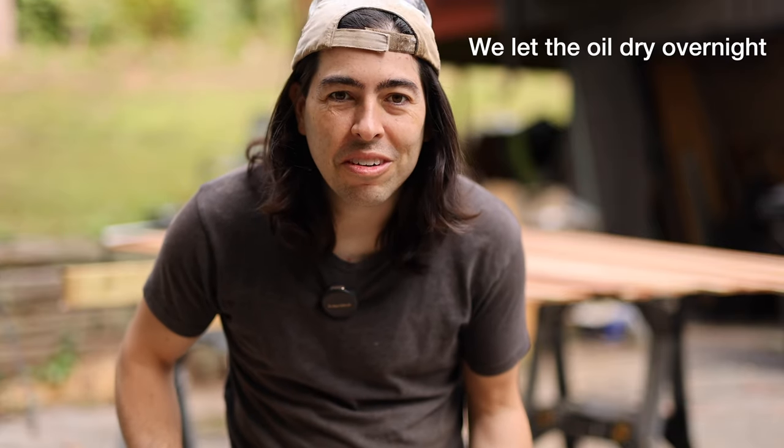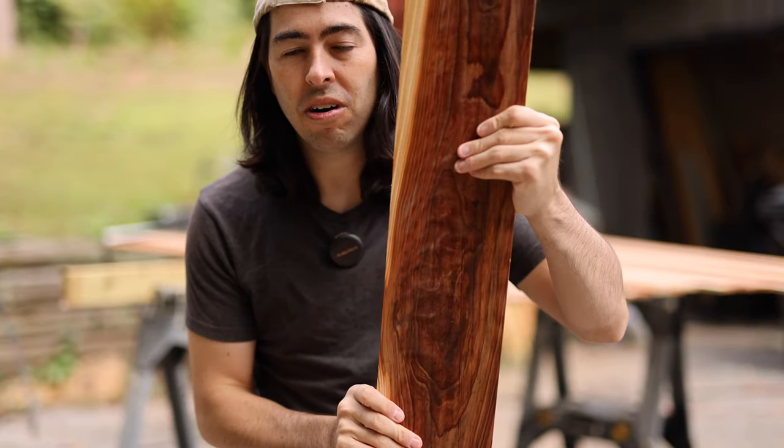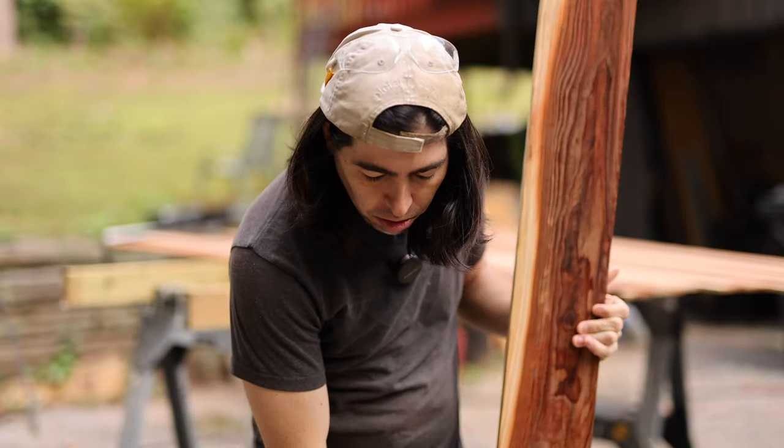Good morning. It's a great day to finish off some doors. So today we're finishing off. We've got to install the cedar. This is one of the pieces that we'll be doing vertically. It has a lot of character to it, so this is going to be our centerpiece. I'll be cutting down a whole bunch though. Some will be horizontal and some will be vertical. So the next thing I need to do is cut everything down to size and then put it on the actual door frame. After that, I just have to make a little lattice opening, which I would say is called the koshi. I don't know what else it's called. But the lattice for the Shoji screen. And then I might have to finish off some rice paper that we have, which is literally applying a finish to it. So we'll see how that looks.